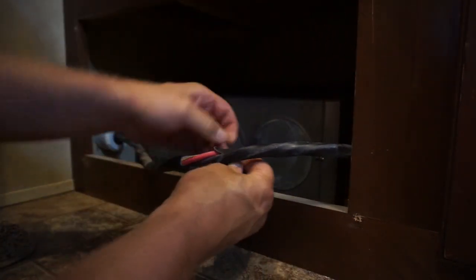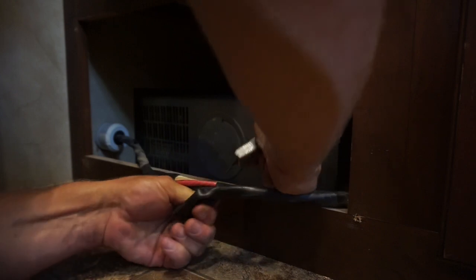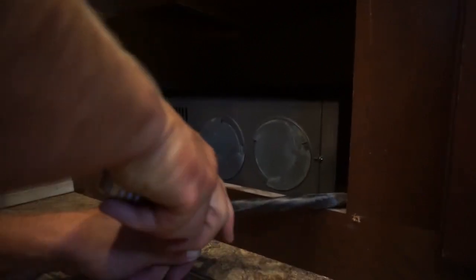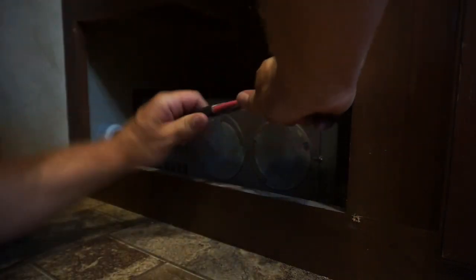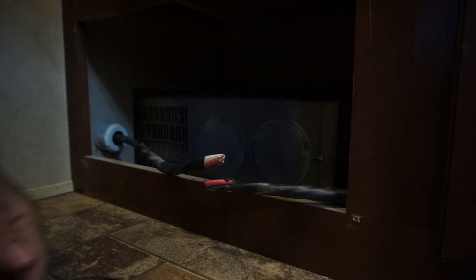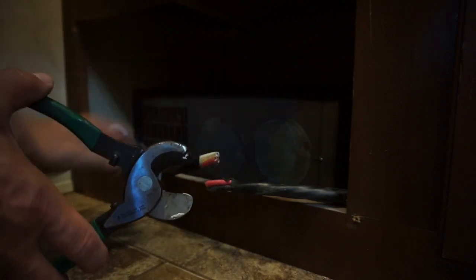You'll see that we've got a bunch of wires in there. I'm going to cut that insulation as well — again, be real careful not to cut the insulation of the actual wire, because that's how people get shocked and how electrical fires happen. We've got the ground wire and three electrical wires. Now I'm going to see if I can cut these — this cable cutter may actually be big enough to cut them all. This is an actual cable cutter you can get at Home Depot or Lowe's for a decent price. It works much better on cable than regular wire cutters do.